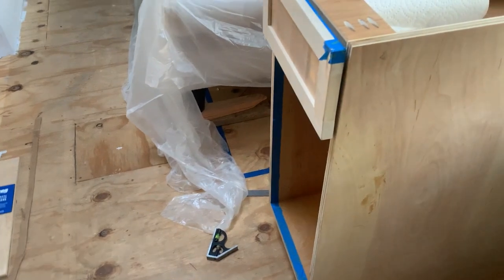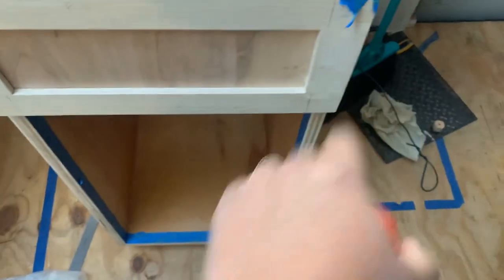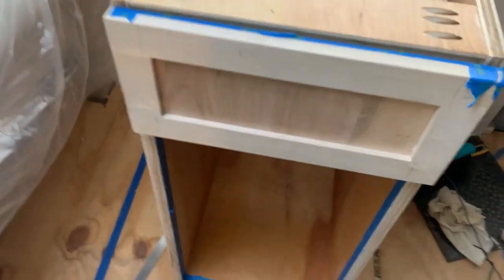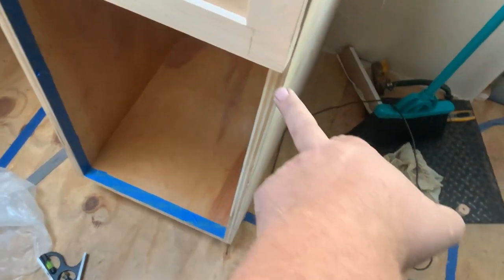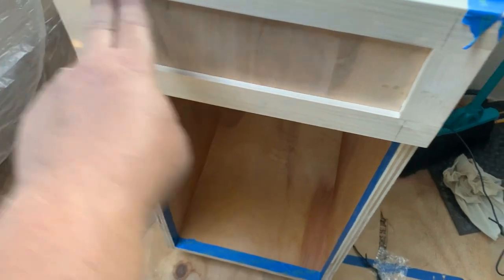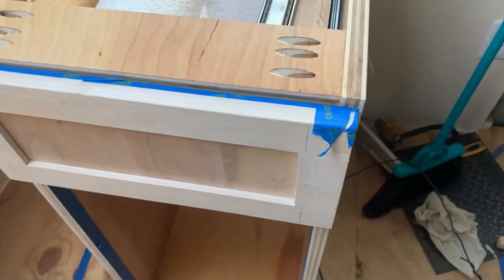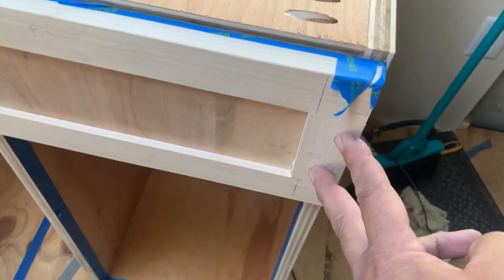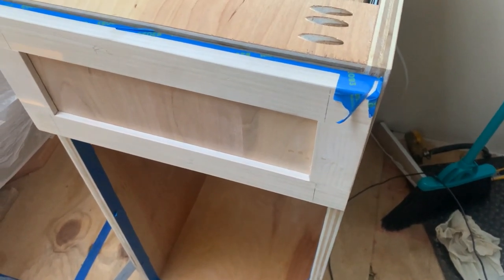We showed you a bit how we built the doors before, but I thought I'd give you more of a step-by-step. I want my door to line up exactly with the width of the drawer, and then I'll leave enough room for an eighth-of-an-inch reveal at the bottom and an eighth-of-an-inch gap in between. To measure, I get 13 and three-quarters by 24 and an eighth, then I'll take a quarter off of that, so it's 23 and seven-eighths. My top rail and bottom rail go all the way from edge to edge, and the stiles will sandwich in between — we'll use pocket screws to do that.